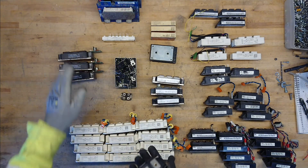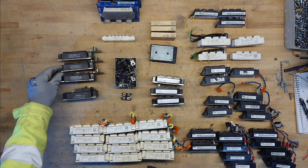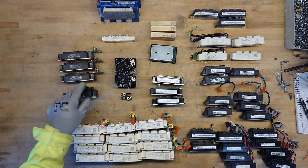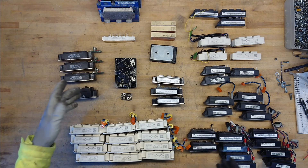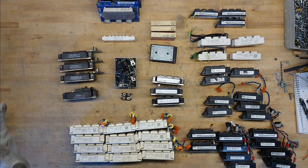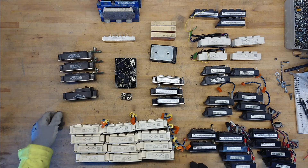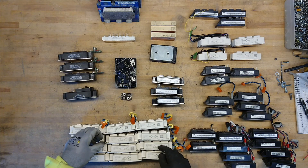These are rather slow and I don't think I will ever get to use them. Maybe some of the plans I have for these is simply destructive testing — put up an LC circuit and test them at how high a frequency and how high a peak current I can push through them before they disintegrate and explode. A kind of very rough exploration test into what you can abuse these IGBT modules for in a dual-resonant solid-state Tesla coil.